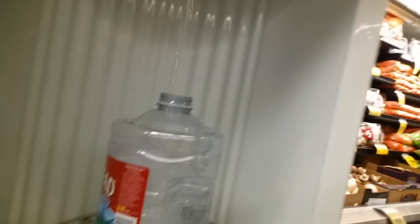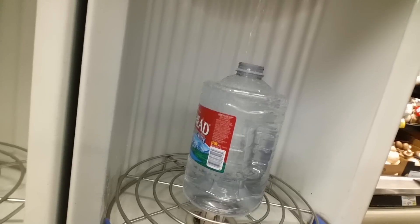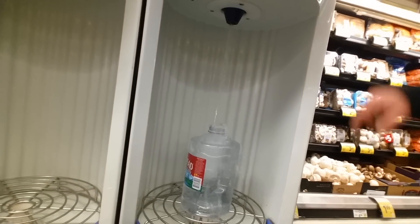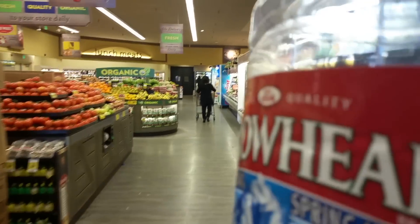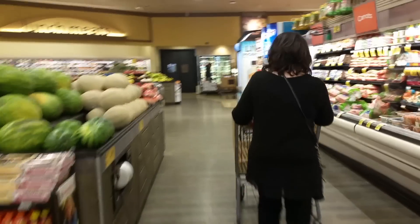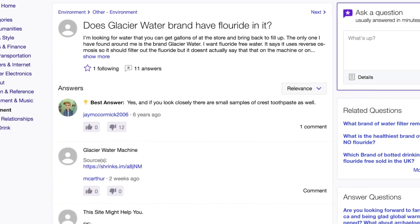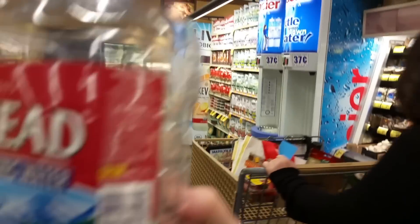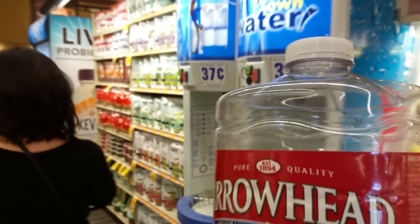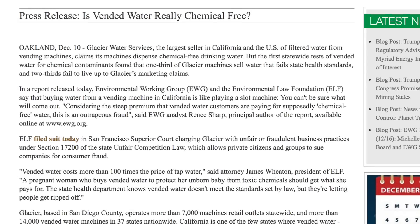I got that information from the Glacier supplier of reverse osmosis membrane filters — that's what they had on their website. I looked that up specifically because someone commented on one of my last videos saying I was wrong in claiming that the machines remove the fluoride that many municipalities still put into drinking water. This person claimed that reverse osmosis did not remove fluoride — in fact, it does. Maybe not all of it, but a very good percentage: 92 to 98%. All of these filtering methods remove most of the harmful contaminants, but it's actually up for debate whether the water is safer than municipal tap water after going through the extra filtering process.